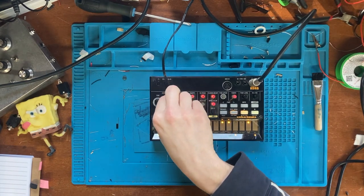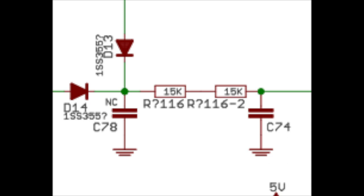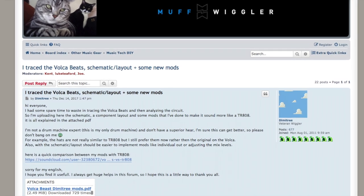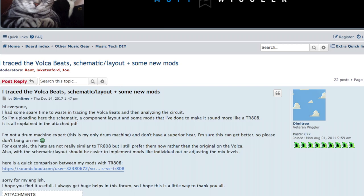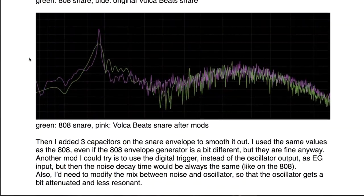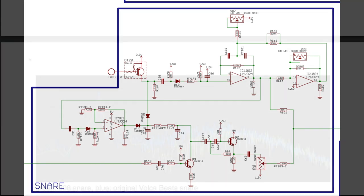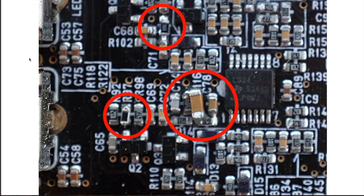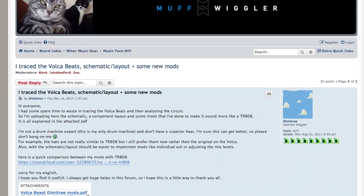It's time to talk about what the component is that's actually added to the Volca Beats which ends up changing the sound so much. There's a component called C78 on the circuit board which was actually omitted from the Korg Volca Beats - it's just two silver pads that if you add a capacitor to, you get all of the top end that was missing originally. I found a blog post by a user called Dimitri and they made a fantastic PDF that shows the full schematic of the Volca Beats including a scale drawing in Adobe Illustrator. The user also includes really good photos of where each individual component is on the board, so I highly recommend you click the link in the description below.